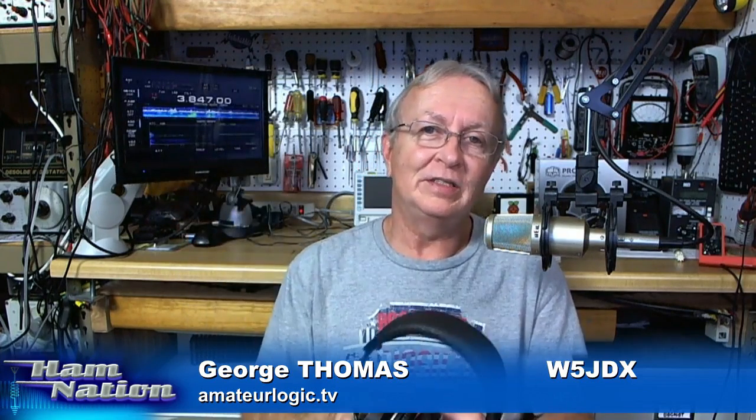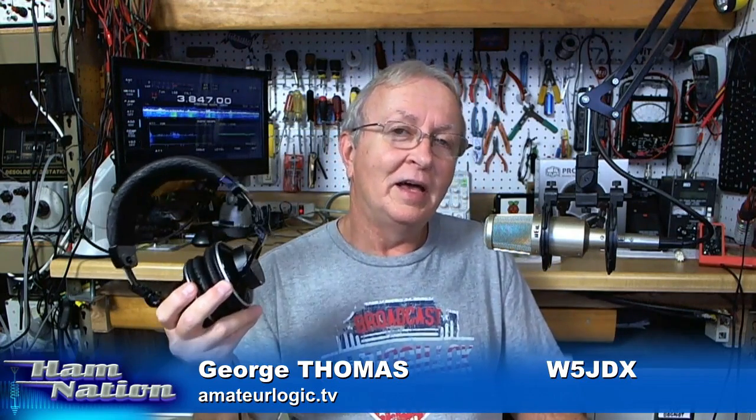I've got something I want to give away — these headphones. Last week when Joe Walsh was visiting, I had this set of Heil ProSat 3s that Heil Sound donated. I asked: to connect a 200-ohm balanced antenna to a 50-ohm transmission line, what ratio of balun would you need? The winner is David Holt, KE5ZZO, and he said it's a 4-to-1. Congratulations, David — we're going to send you these Heil ProSat 3s, and you'll have them in time for field day. For next week, the prize is a book from Drew Diamond, VK3XU — QRP Projects from Down Under, from MFJ Publishing. It's got lots of great projects in it, including how to solder aluminum.